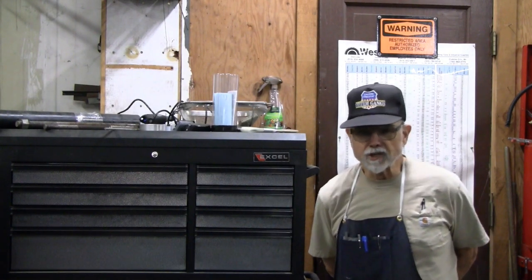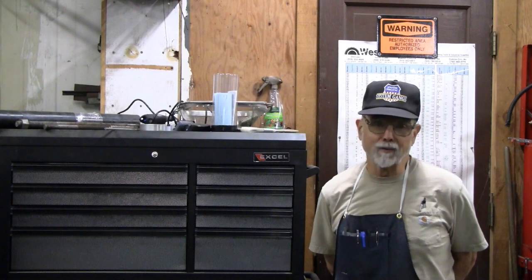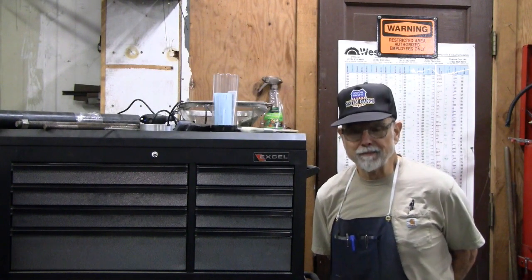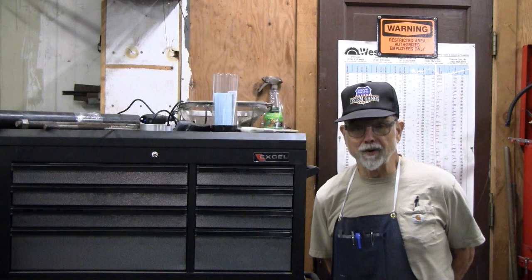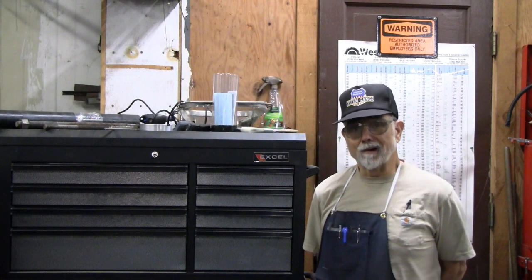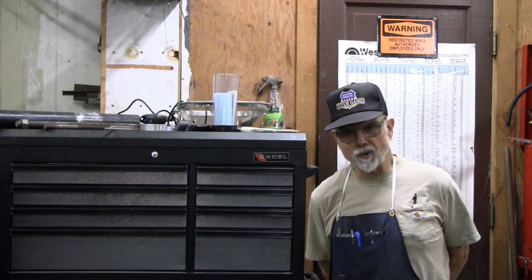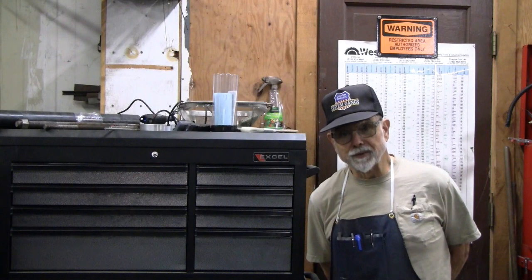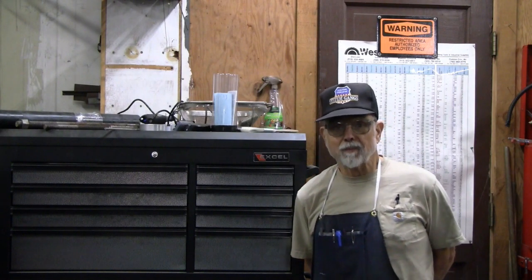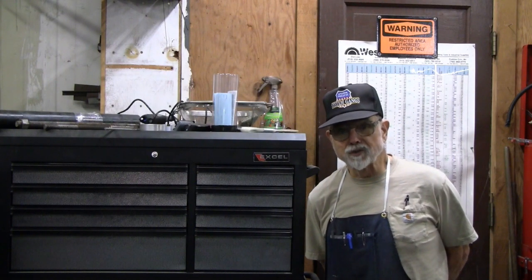This will be the second and, I hope, the last video in what I hope is a two-part series on my cheap eBay die grinder. The first video showed me making a new arbor for a diamond dressing wheel. That arbor worked out fine, but it turned out the collet was way undersized for the bore of the spindle, so I'm going to continue to try to salvage this almost worthless machine by making a new collet that should fit better and should result in much less runout.